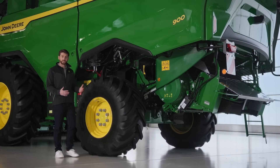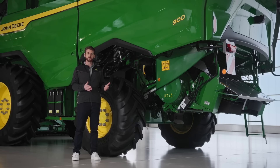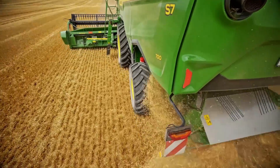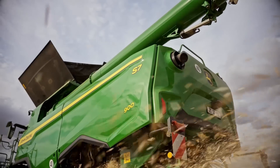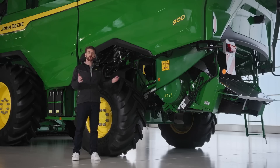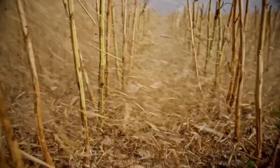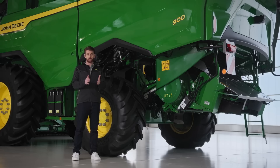Residue management is of critical importance on a combine harvester, so we've updated the residue management system on the S7. This now has the XL knives from the X9 with the low-resistance golf ball indentations. We've also introduced additional air vents to the combine to improve the airflow on the cleaning shoe. The spreader is now mechanically driven, ensuring all of these components work together in harmony — maximising the available power for harvesting and delivering efficiency gains, both of which deliver more tonnes of crop for fewer litres of fuel.